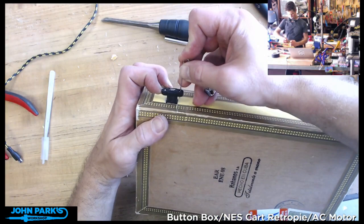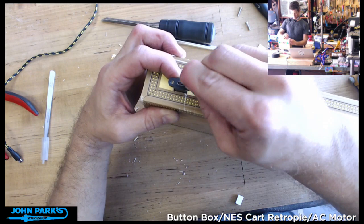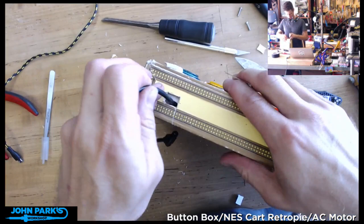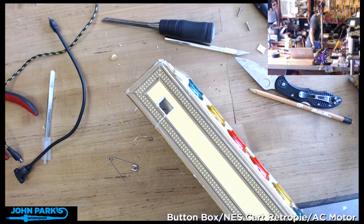Yeah, and as I remember, these holes are really close to the edge. Luckily, this thing's pretty bendy rubber, so it's hard to make a hole big enough for this screw without just going into the inside of the cutout. Okay, and pull this through. I'll show you a tool I like to use for these things, a little hand drill or a Yankee twist drill, they call them.